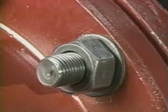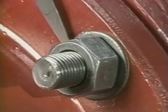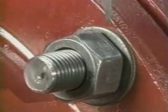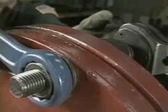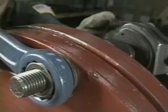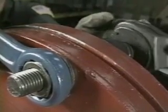Check them one day, one week, or a year later. Additionally, since DTIs measure clamping force achieved, not torque applied, you'll get an accurate measurement of clamping force in your critical bolted joints.